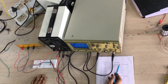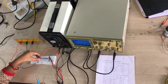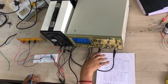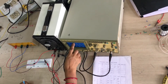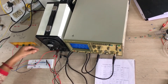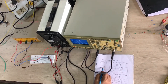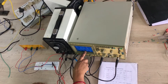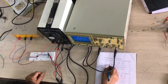Now the same setup is used for AC input voltage. We connect the signal generator to the input. The output is connected to the CRO — channel 1 is your input and channel 2 is your output. We are accessing 0.1 volt AC input. To read the output: one division multiplied by 0.1 gives 0.1 volt. Counting the output waveform height — 4.4 divisions multiplied by 0.1 gives 0.44 volt output.